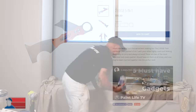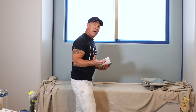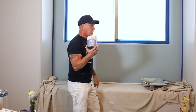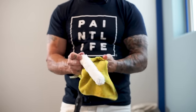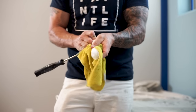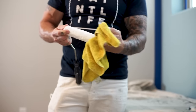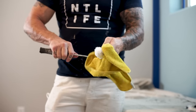Here's the finish itself. On a project like this — an average-sized powder bathroom — you'd only use two quarts of this product. It goes a long ways. Prior to loading up my roller, I've got just a microfiber cloth that's really wet and damp. I want to pre-wet my roller and just kind of work it in, get any loose fibers off of it.